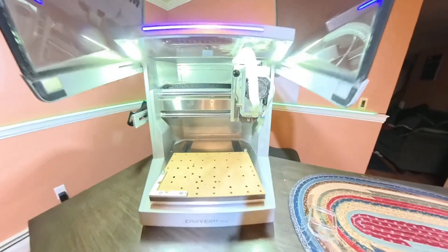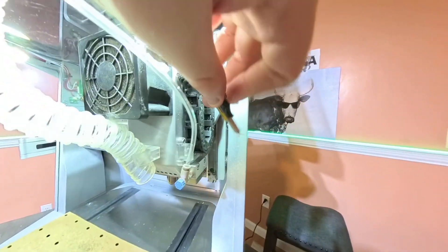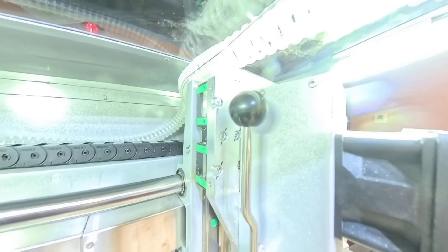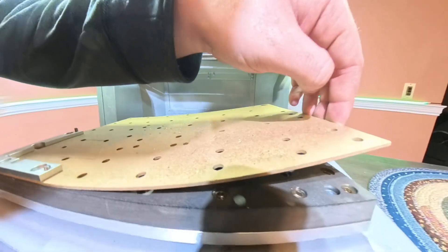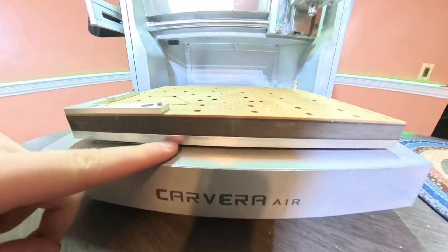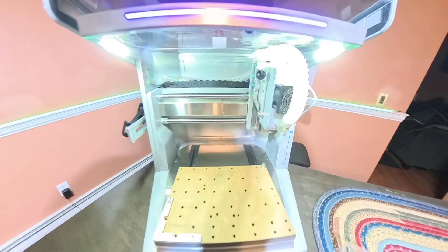Going inside the machine, you have a handle right here which you pull for changing tools and inserting your Z-probe axis — it sits very conveniently right here. Pop it in and you can get your Z-axis heights. Very nice having it tucked there for easy storage. It has linear guide rails for the Z-axis, which is pretty nice. Wire cables are all tucked away nicely, and you can see how bright it is inside. The bed material is right here with aluminum underneath. In the back corner, you have your touch probe, which figures out your tool length.